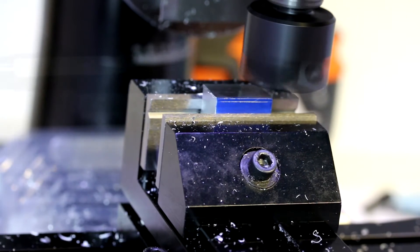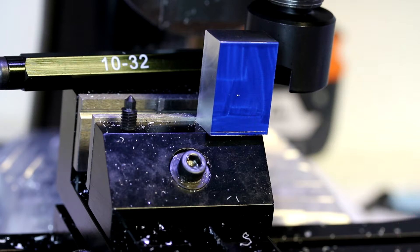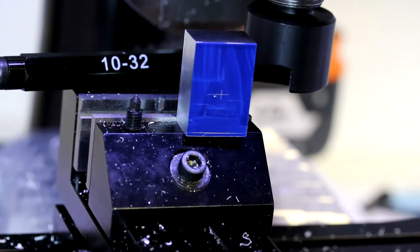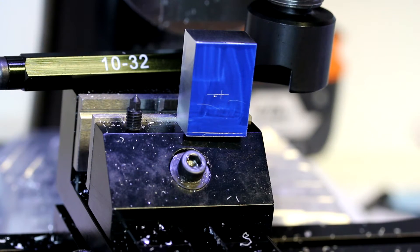This measurement isn't super critical. Rather than attempt to measure to the center of that hole, I'm going to use a transfer screw to make the measurement — it acts as a center punch for where the hole is located. I simply put the piece with the top pressed against the bottom of the table and gave it a tap with the transfer screw in the hole to get a mark. I don't want to use that exact location because I'd be rubbing against my table, so I used a caliper — the mark was about 0.59 from the top edge — and went 0.575 to make it a little bit shorter. That gives us one mark. Next I measure the width, cut it in half: mine is 0.72 wide, so half is 0.36 as my center line, and I marked a cross point where we'll drill our hole.